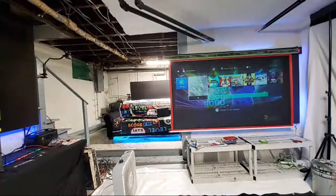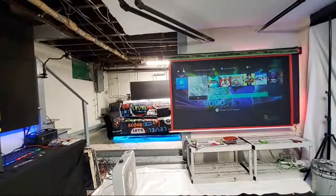If you look upstairs in the tech room, I got them running all through the tech room, there's a power supply running for every 3. I found out the hard way. When I was connecting them, I was like, wait, why are the lights so freaking dim? And I pulled out one of the connectors for the 4th, and it got bright. I was like, oh, it has to be a power supply for every 3. You just have to remember that when you're installing them.